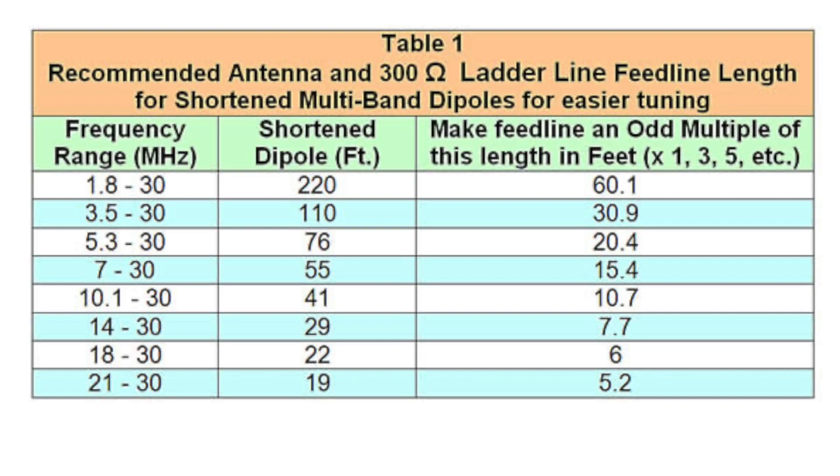A no-compromise dipole antenna is cheap to build. I built this thing out of basically spare parts — old wire from the garage. I bought a strain relief and some 450-ohm ladder line, and originally a very short 10-foot piece of coax to terminate that ladder line outside my shack. One of the speed secrets: there are certain lengths of ladder line you want to avoid — I'm not going to list them all, you can look them up yourself.